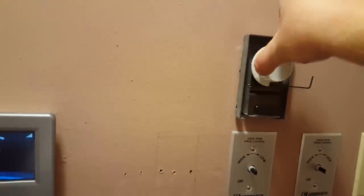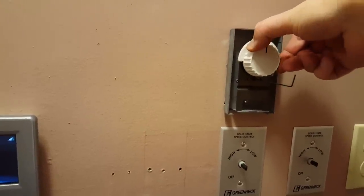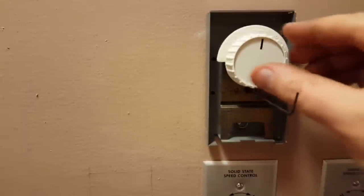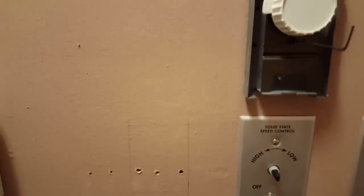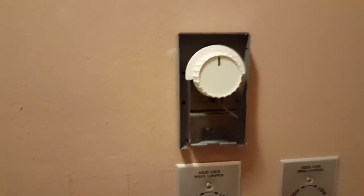For example, the fan's off right now. It just clicked — so 70 is straight up and down, it just turned on. And it just turned off. So you've got the hysteresis part — the middle of it right where it would be 70 degrees right now. So there, that's calibrated.